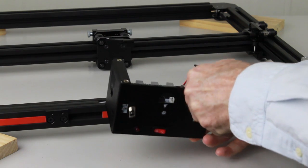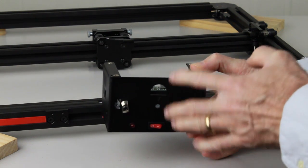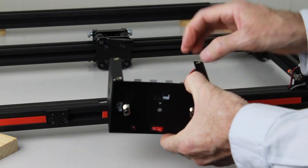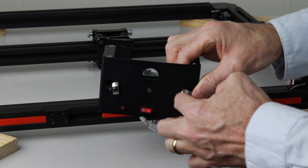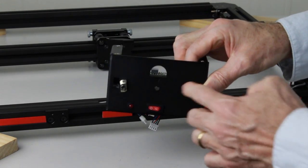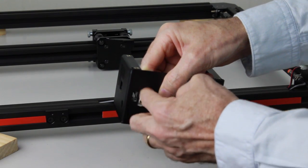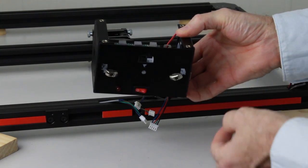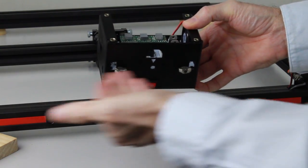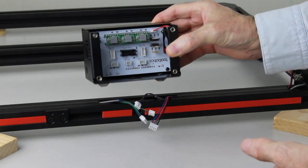Before we insert the cables, we need to loosen the T-slot nuts that will hold the control box to the frame. To do this, we just need to wind them out until they're flush with the top of the bolt. This will aid us when we stick them in. They also need to be running this way when we drop them into the aluminium frame, like so.